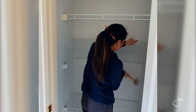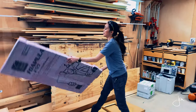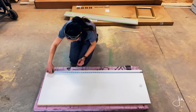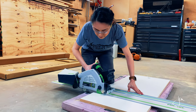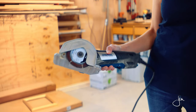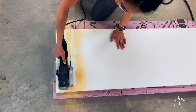I picked up closet rod pull sockets, some 1x2s for trim, and some melamine shelves from the Home Depot — it costs about $120 for all of the materials. These shelves are pretty strong but easy to cut to size. I use foam board insulation as a cutting mat — measured and marked where I wanted to cut the shelves and then made the cuts with my track saw. You can also make these cuts with a table saw, a circular saw, or this mini saw called the Dremel Saw-Max — it's so small it'll fit in your kitchen drawer. It's best to clamp a straight edge so that your cuts are straight.